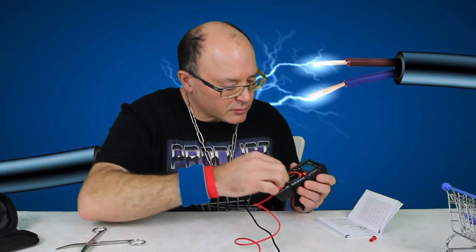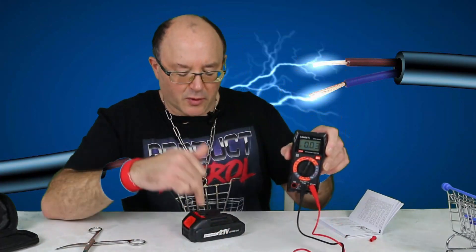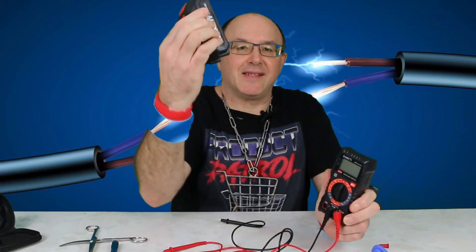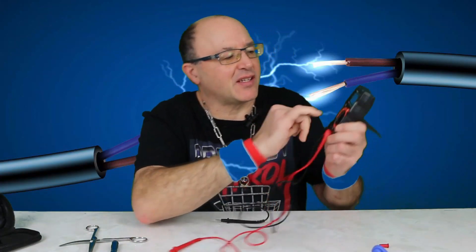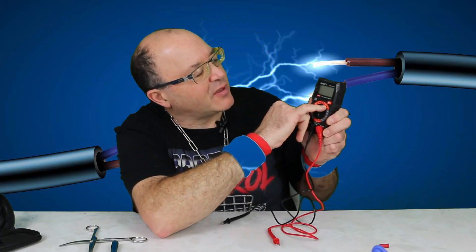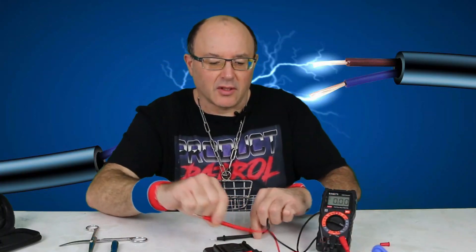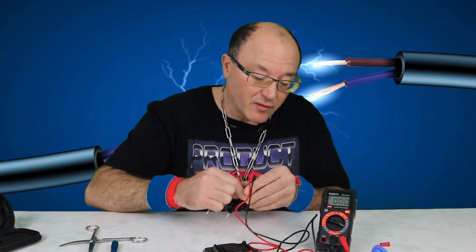Okay, let's turn it on. We're going to be testing this 21-volt battery. I think it might not show enough power. This is over 21 volts and we have it set to 20. Now this is going to be DC. It says the V with the wave symbol here is for AC — we want DC. I'll set it to 20 but it might not work because this might be higher than 20 volts.